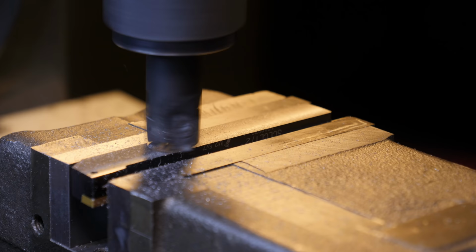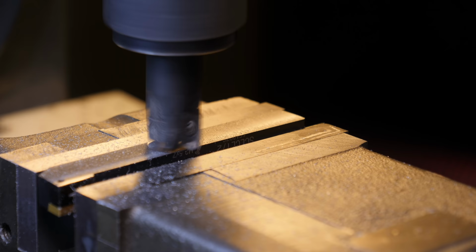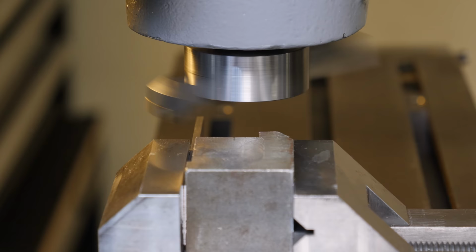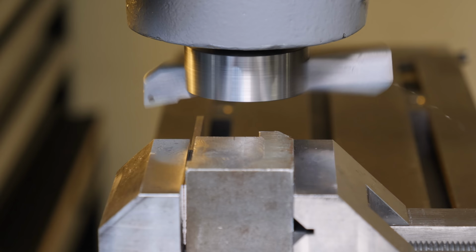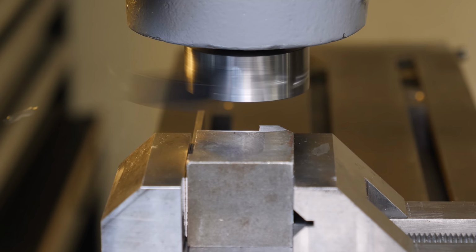Exactly. I bought a lot of random tools off of eBay, and the lot worked out to be about $5 a tool, and one of those tools was a shop-made fly cutter. I didn't really like the tool bit that came with it, and I never used this particular cutter, and I've been trying to change all of my tooling over to insert type tooling, so I just cut it down and made it work. I've made a lot of cuts with this cutter since I cut it down, and so far I haven't broken the insert or rotated it.